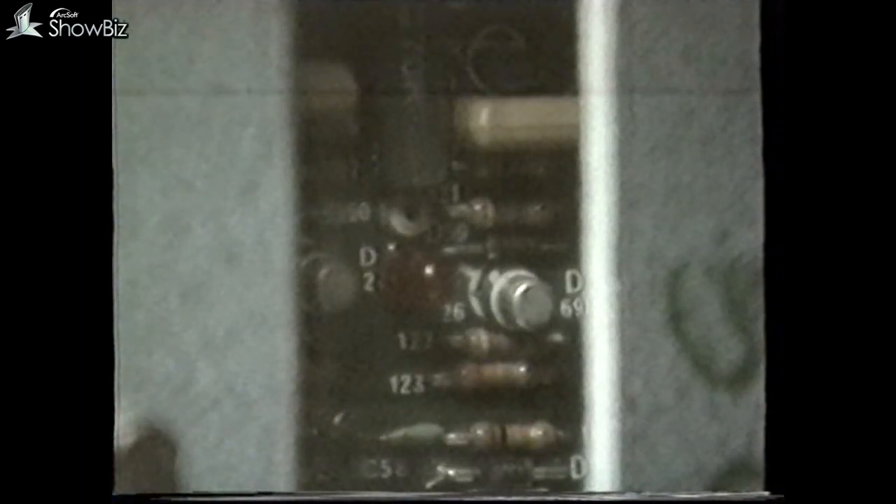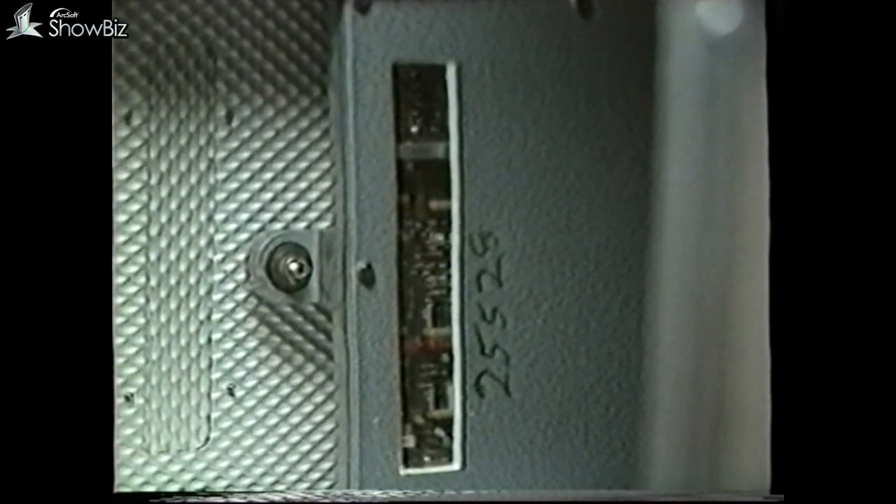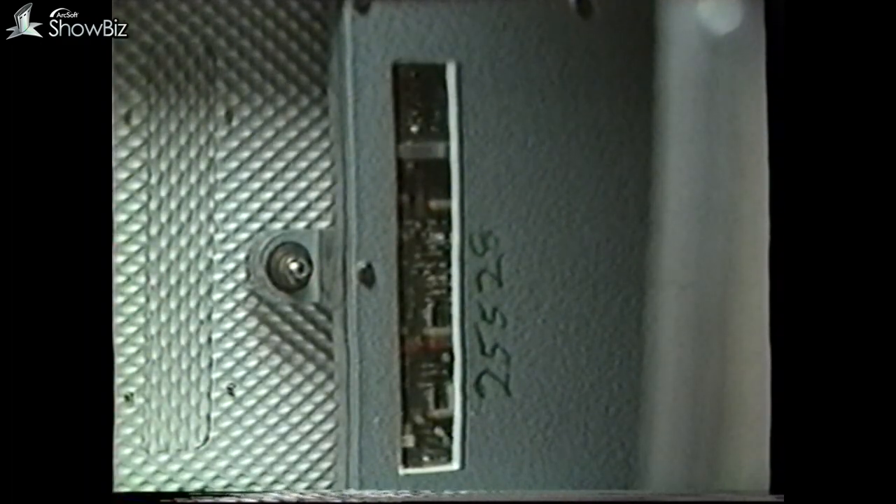On the control panel there is an inspection window through which the panel warning light can be viewed. Under normal conditions this light is out at all times. However, if the panel detects an electrical overload — due for example to a two-gear selection — the light will be on and the panel will place the transmission in neutral. This condition will remain until the problem has been corrected.